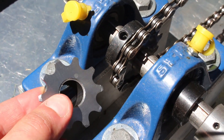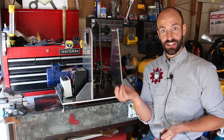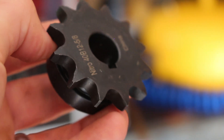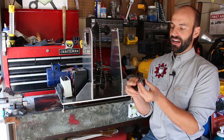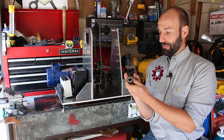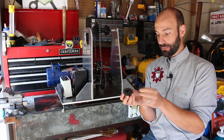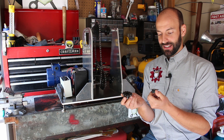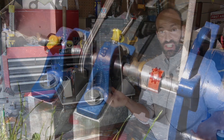One of our students, Kyle, had a really slick idea. He took a number 40 sprocket off the shelf for cheap — it's a standard industrial sprocket with a half-inch pitch and can have any kind of bore. This one is for a 5/8 inch shaft with a key. All he did was face it and then grind the teeth down until it was about 90 thou thick and fit perfectly with our bicycle chain. He hogged away some material, which takes some time, but using that method and some calipers to verify the thickness, you can make any kind of sprocket you want for your bicycle to mate to any shaft you want — for way cheaper than buying a custom part online.